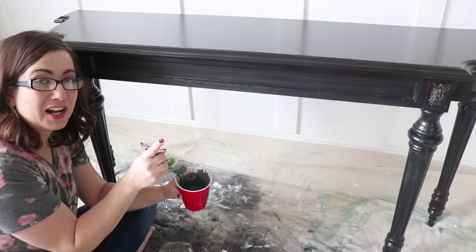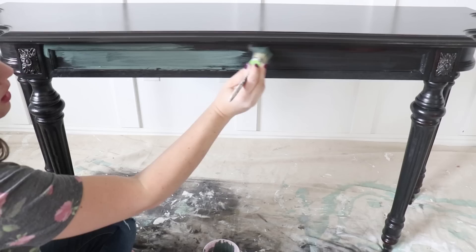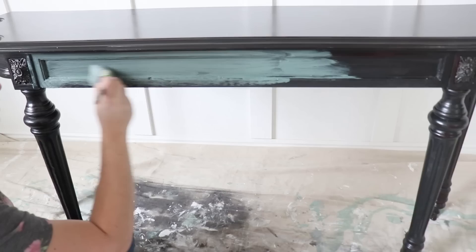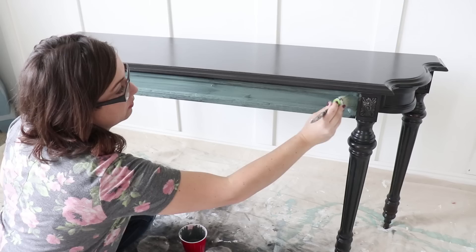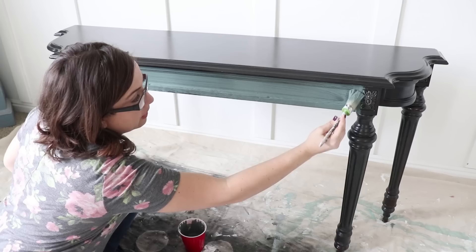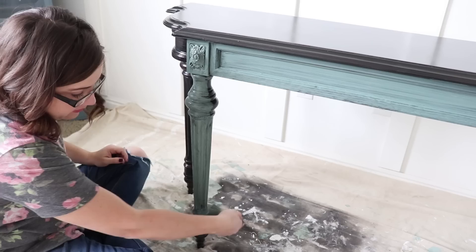If you want to get this paintbrush, the milk paint, the DIY paint, or the Big Top, you can pick all that up at jamierayvintage.com. I'm just going to come in and give us a coat of milk paint. This is going to take two coats before I'll have complete coverage. The first coat I like to go on kind of lighter, and then the second coat will fill in the gaps. You want to make sure once you get the paint on there you get in all the cracks, then come across with your brush and smooth out all your brush strokes so you have long, fluid motions. Milk paint is very forgiving, but fluid brush strokes will get you a better finish.